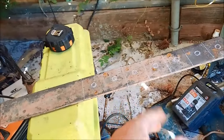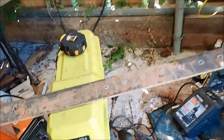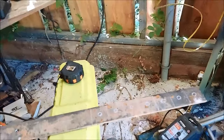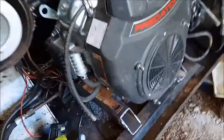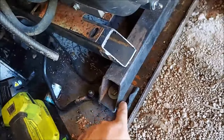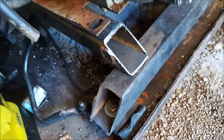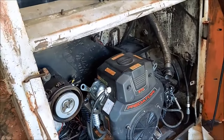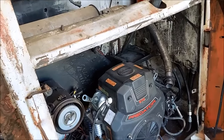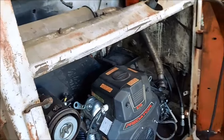So I already did all my lines. I'm going to drill first and then take it to the chop saw. That way I have something I can grab hold of while I'm drilling. And hopefully it'll go through there pretty easy. Got to build a bunch of spacers, and those spacers are going to go underneath here. So I'll loosen my isolator, lift it up, because I have enough play on the bolts length. And put the bolt back down, be good to go, get my right setting. And then I just got to measure right to left again and make sure everything's good and tack her down.